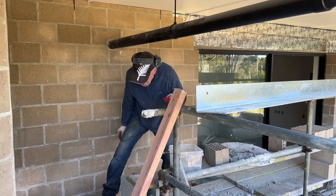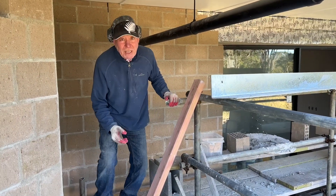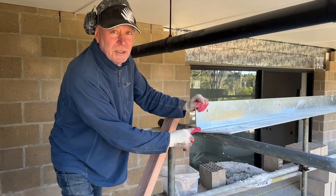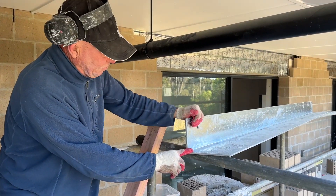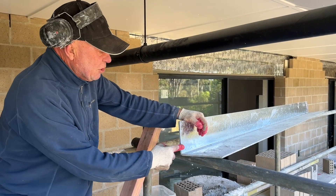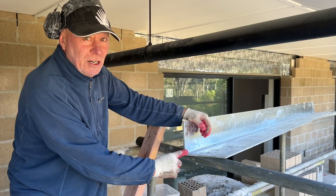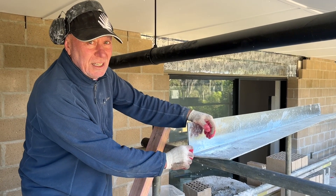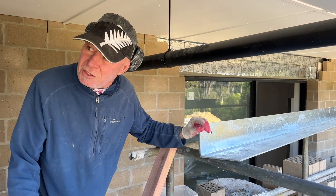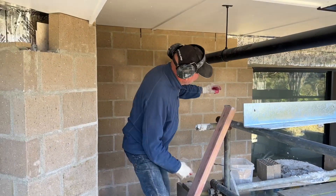Here's the big lintel — it's a three-meter lintel, bent out of 8mm steel, purpose bent, and then galvanized to save money. The nearest equivalent in angle iron is 13mm thick, 200 by 200, which is massive and not required.